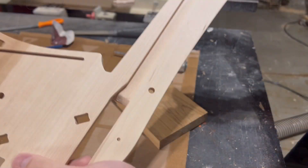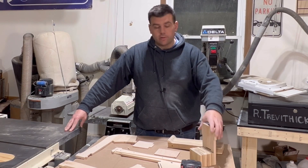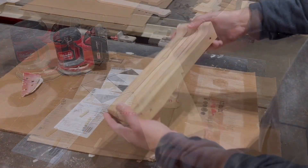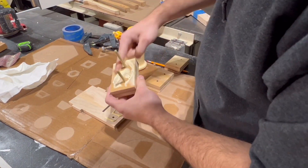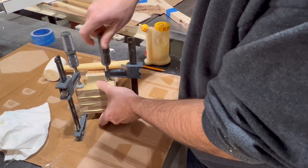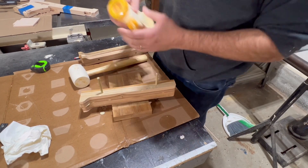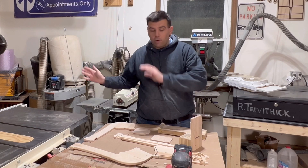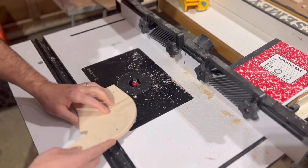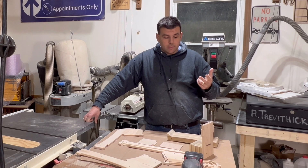Crawling around on the ground was annoying, but I think I fixed all my issues. I went back and assembled everything, made sure it worked, tested it a whole bunch of times, and didn't run into any issues. Once everything was fixed, I went ahead and started to glue up the back stand as well as the launch ramp, using dowels and making sure everything was aligned correctly. For the back cover, make sure the ramp is facing to the left when looking at the machine from the front so it guides into the ball return. For the ball launch, make sure the two components with four holes are on the outside of the ramp as locator pins into the side panels. The last thing I did before sanding up to 220 grit was round over the outside edges using my router table.